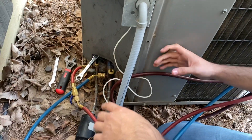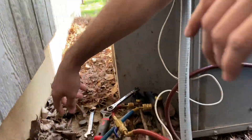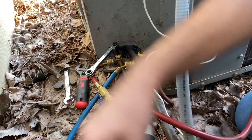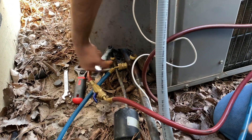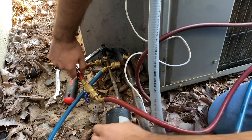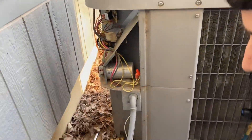The compressor's pressure is pulling the refrigerant in inside the condenser — that's how you pretty much trap your refrigerant. If your condenser is big enough, you get most of your refrigerant inside the condenser. You're doing that because you're going to cut these lines — there'll be no more refrigerant in the lines, no more in the coil. Once it starts running and the compressor starts running, close it off.